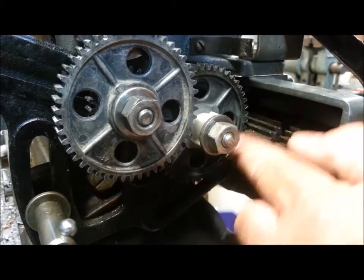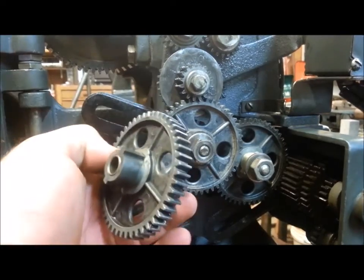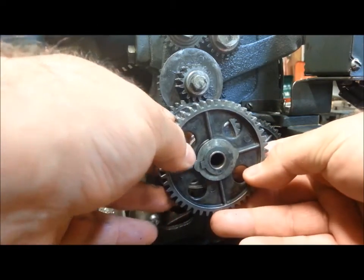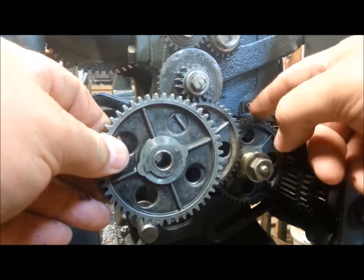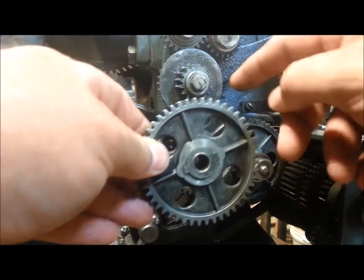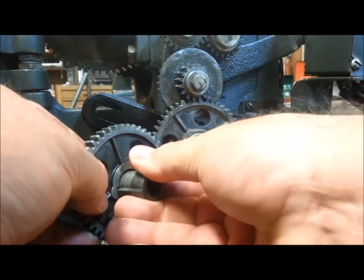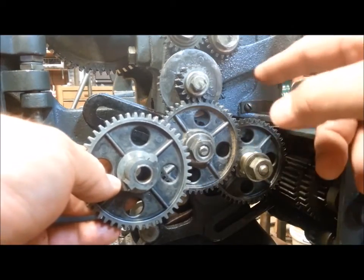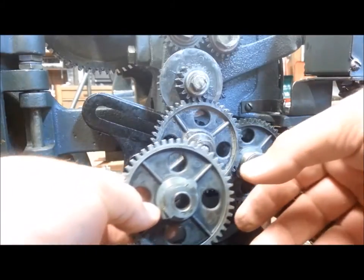Normally this 48-tooth gear and this 48-tooth gear are sitting on the same shaft. When the compound gear I made with the 48 and 24 behind it is not here, this slide gear takes its place — normally out towards the front, engaging with this gear. This slide gear can also be moved back on the shaft to engage with the big part of our compound gear, giving us no gear reduction to the gearbox. That gives us our very fastest feeds and lowest pitches — 4, 4.5, 5, 5.5, and so on — on the top of the Atlas quick change gearbox.